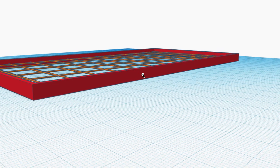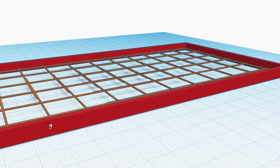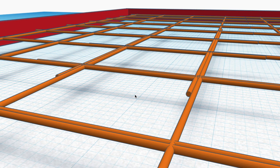If you're looking for a better illustration of exactly what I mean by compression versus tension, there's an excellent video I watched that helped me really wrap my head around exactly where in the concrete I should put the rebar and why. I'll put a link down in the description. Now, I'm a very visual person, so I decided to model my forms and the slab itself in three dimensions. This allowed me to lay out a grid and decide exactly how many pieces of rebar and in what configuration I would need. You want to make sure the rebar is not going to touch the edges of the form, because you don't want water to get in and rust the rebar inside your slab after you've poured.